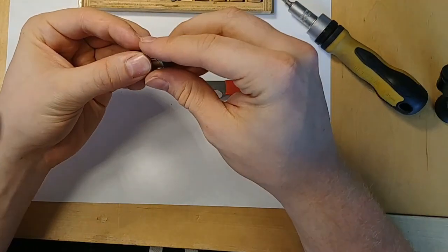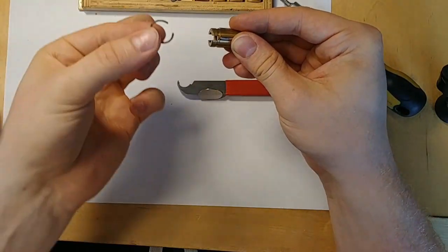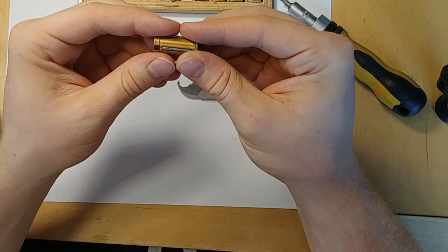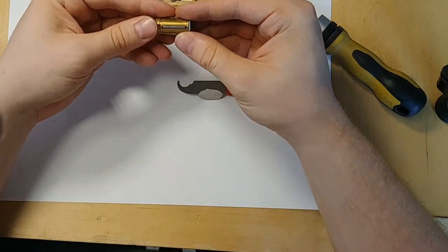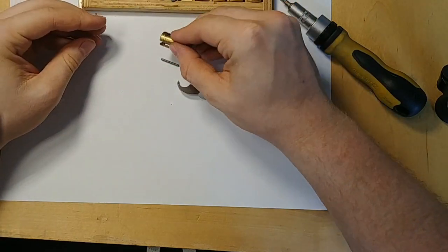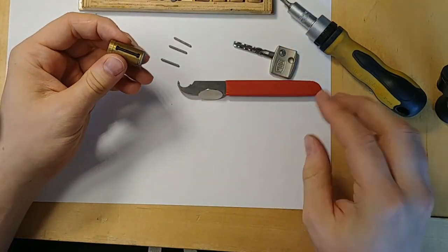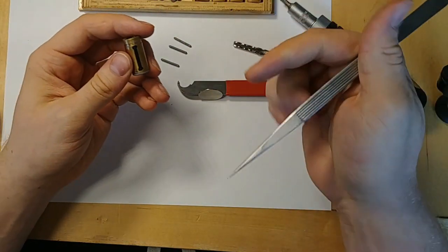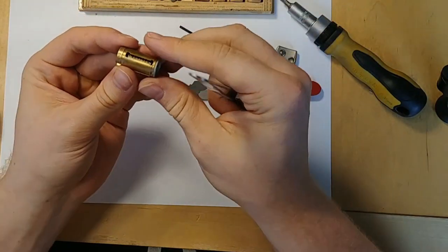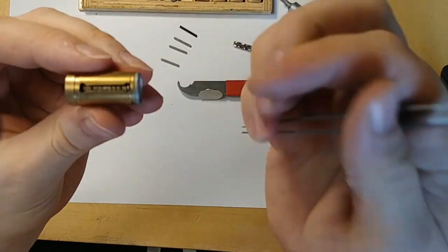And the fun thing is, when they designed this lock, I think back in the 90s or so, here's the C-clip, they said, okay, let's make a sidebar mechanism, but that's too boring. Let's give it not only one sidebar like here, let's give it also not two, and maybe also not three, but maybe four is too much. So let's give it 3.5 sidebars. So here we have a plastic sidebar also. Every 90 degrees we have a sidebar. The plastic sidebar belongs here.